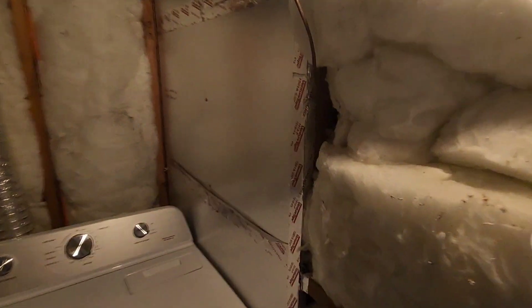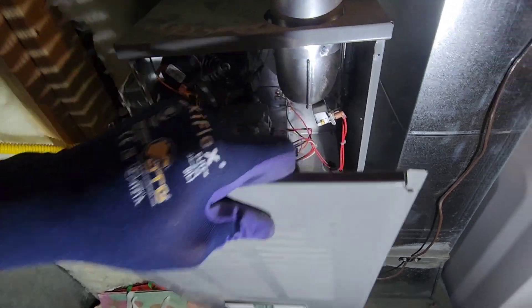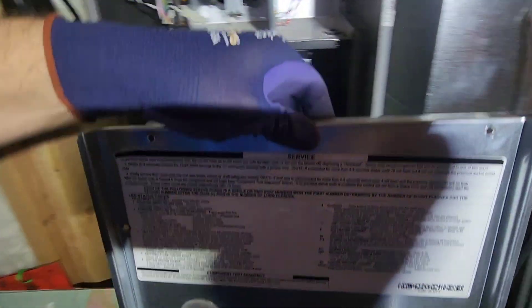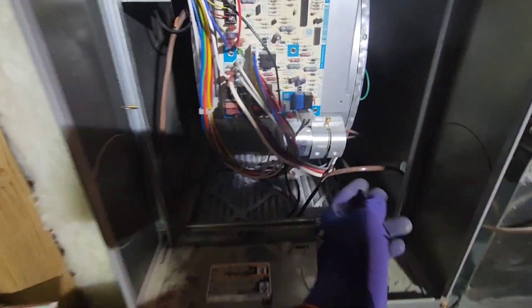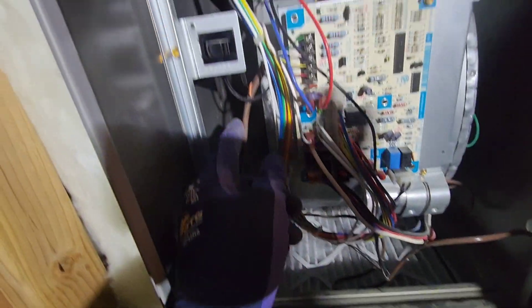Let's go ahead and look at the furnace — go behind this wall. This is the wire that goes from my thermostat up there. It comes down into the side of the furnace here. Let's pull this cover off. Although this is a Day and Night furnace, the steps I use to fix this furnace are definitely transferable to other brands. You can see the thermostat wire winds around here, goes up here, connects onto this board. Everything looked good there on the board.